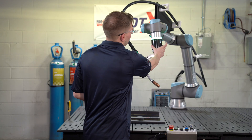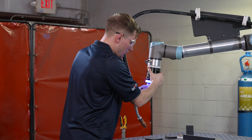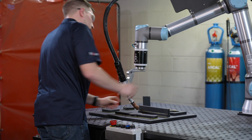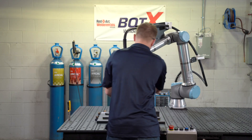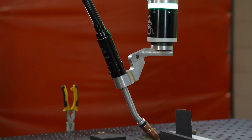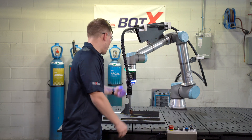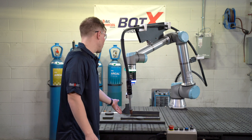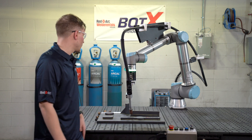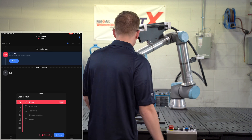What I'm going to do is take our BotX, press and hold the top button which is the free drive, and drive the robot down to the initial start point of where I want this weld to go. From here I'm going to make sure the robot is on a 45-degree angle to the joint, and with the hard wire we're going to be pushing this puddle. Once I'm satisfied with the torch location, position, torch angle, and traverse angle of the joint, I'm going to tap the bottom blue button and save this position as the start point of this weld.